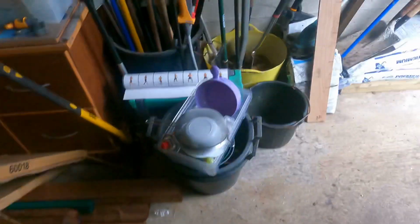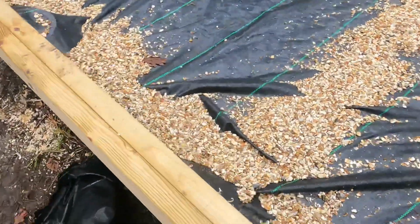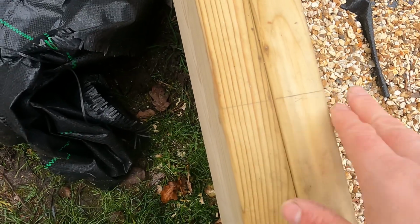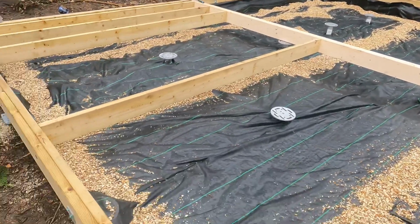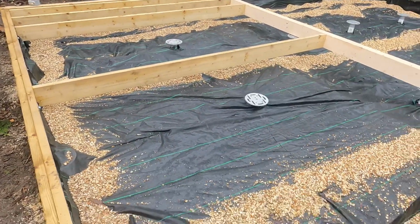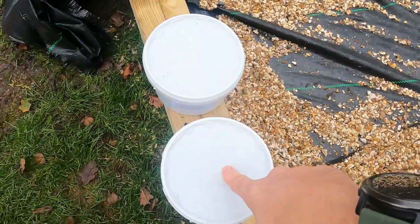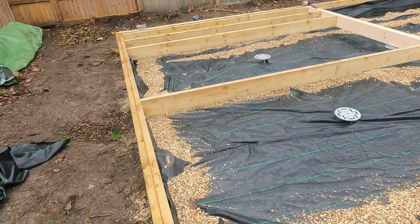But what I'm going to do is, when I put the floor down, you don't want any sort of discrepancy. You want it to sit in lovely and flat. So once the joist hanger wraps up over the top, I'm just going to mark it out and then cut that out with a router or skill saw and a chisel all the way through, even on the glulam beam and the next glulam beam, vice versa. So when you come to sit your floor on, in my case a 22mm Egger board, it will sit lovely and flat all the way through. Because the last thing you want is a 2 maybe 3mm plate, and then you've got your twist now, which will probably sit up about 5mm, and you don't want any sort of dip in the floor. You want it lovely and flat.